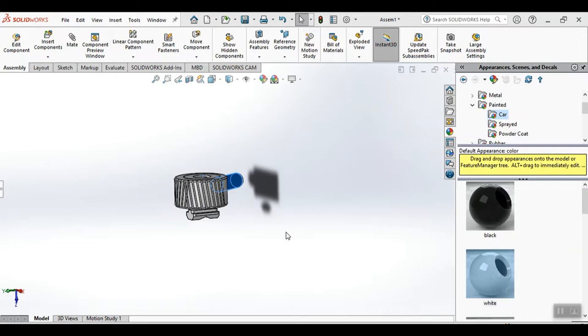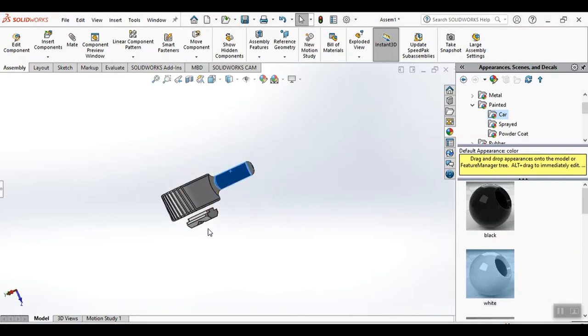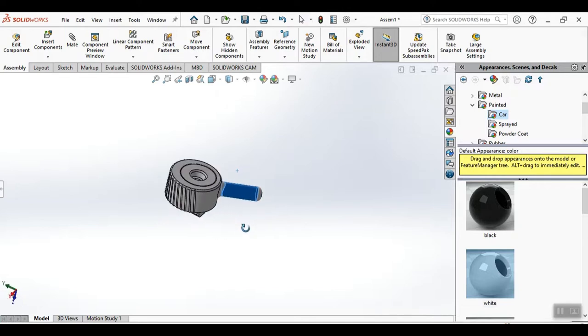Here's a look at the assembly in SolidWorks. To rotate this, you can see the T-nut on the bottom — it's a 4mm T-nut. The cam action at this point is at its fullest, but as we rotate 90 degrees, the cam action goes to its smallest amount, then fullest, then smallest again. We always want to be rotating towards the fullest amount, because these serrations on the side actually push the workpiece down as it's being clamped.